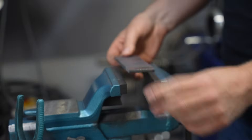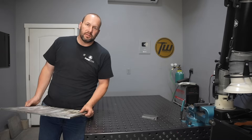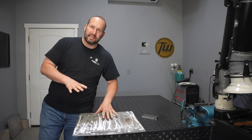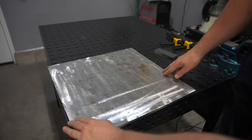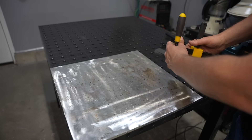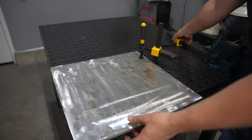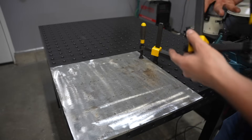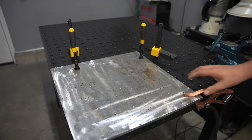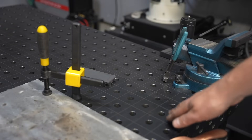Go ahead and flip it over and do both sides. I have this aluminum plate I've been using for a long time to protect my welding table when running demos. It's warped quite a bit over the years — it'll rock around a quarter to three-eighths of an inch — so I'm going to clamp it down. Clamping your project in place can be pretty important because if your project is moving around, it's really hard to get a nice consistent weld. I'll connect my work clamp directly to this plate and ground through it. I generally try to avoid grounding through my welding table now that I have one with a coating on it.